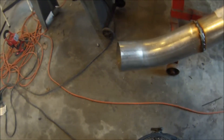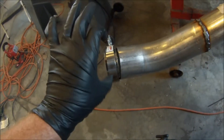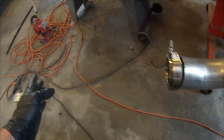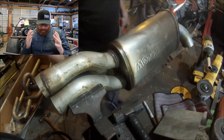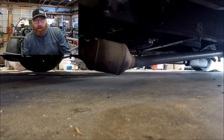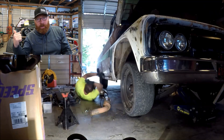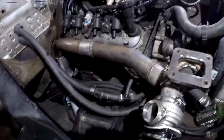We have the two-and-a-half inch V-bands which will weld right here. I'll probably just slit this a couple different times and kind of crank it down. We'll come out with the two-and-a-half inch back to this Magnaflow muffler that was given to us. It's really that easy — jump in, build your exhaust manifold. If it doesn't work, throw it in the trash or hang it on the wall and buy one. The passenger side is mounted and it even clears way down there at the bottom.